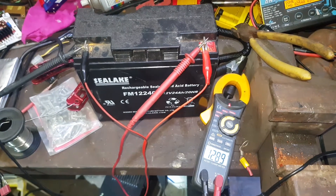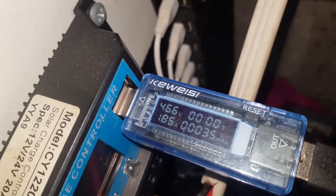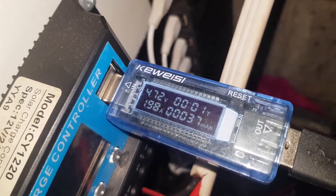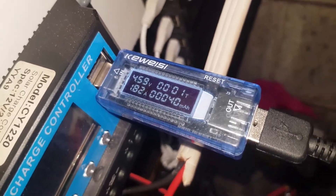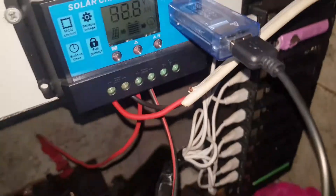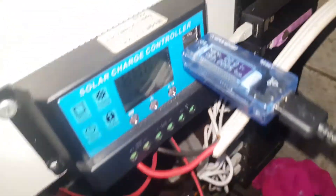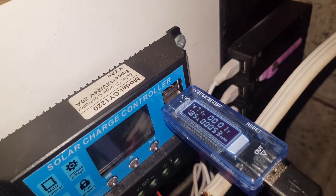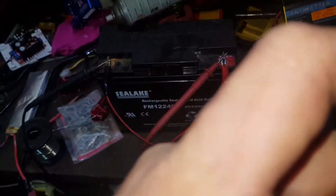2 amps at 5 volts is 1 amp at 10 volts. Take another 20% off - that's 800 milliamps at 12 volts. We're at 14 volts so take about 600 milliamps roughly before inefficiencies. I'll show you the little meter I've got. Top left corner you've got voltage, top right corner time, bottom left current amperage, and milliamp hours over here. We've got my housemate's stuff running in there - lights and a fridge and USB chargers, only on this little bank of eight sealed lead acids.